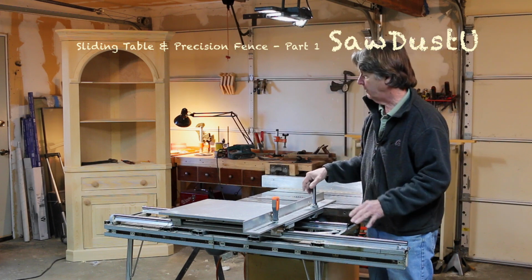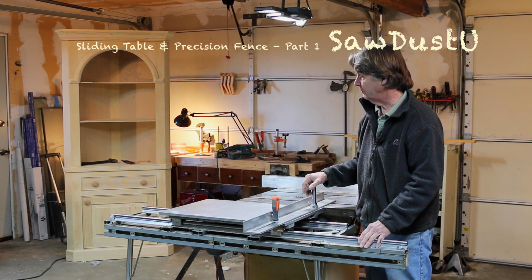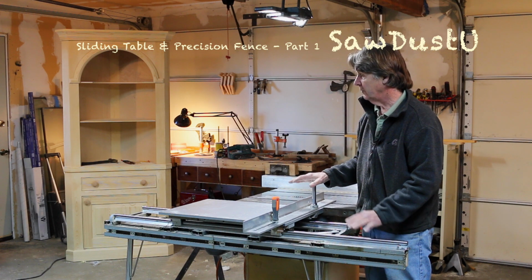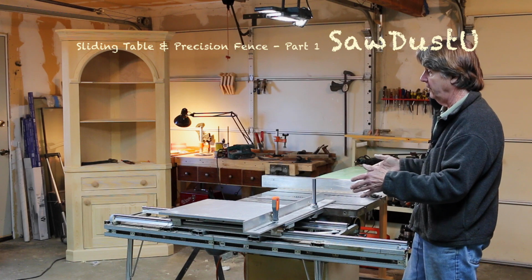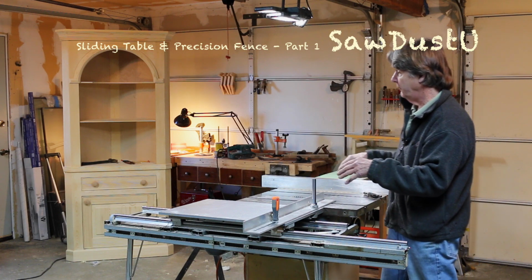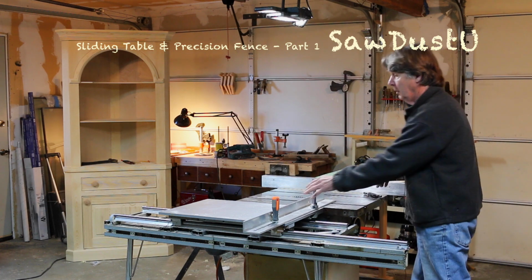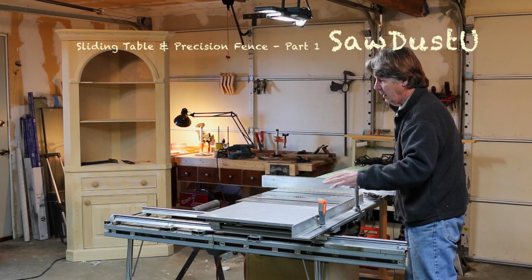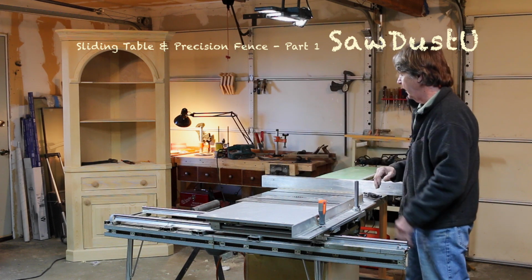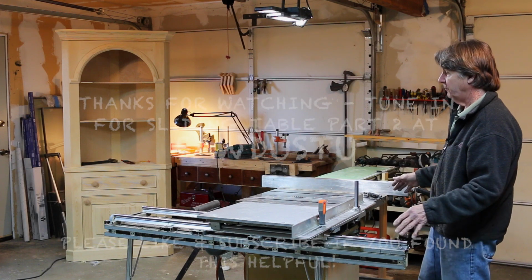I dare say it's more accurate than the panel saws you see at Home Depot, which cost $6,000 or $8,000. So it's a slick system, so it enables me to cut my panels down to a workable size, plus or minus an eighth of an inch. Then I can bring them in here to the table saw, and with this size sliding table and the fence here, I can work with the panel in a reasonable thing and get a great deal of accuracy with the fence. So I'm going to go ahead and we'll stop this video at this point.